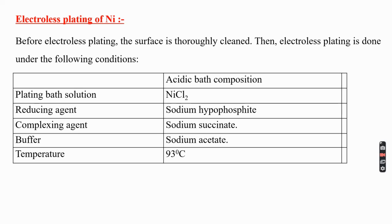Metals like aluminum, iron, copper, and brass can be directly plated without activation in the presence of reducing material. However, stainless steel must be activated by dipping in a hot solution containing one-to-one sulfuric acid. Magnesium alloys are given a thin layer of zinc and copper.